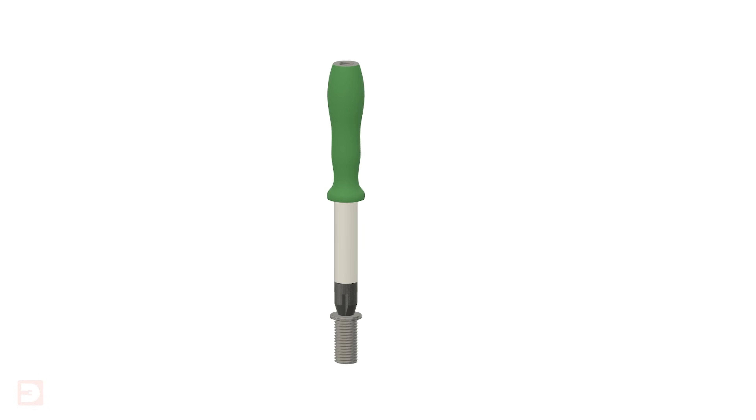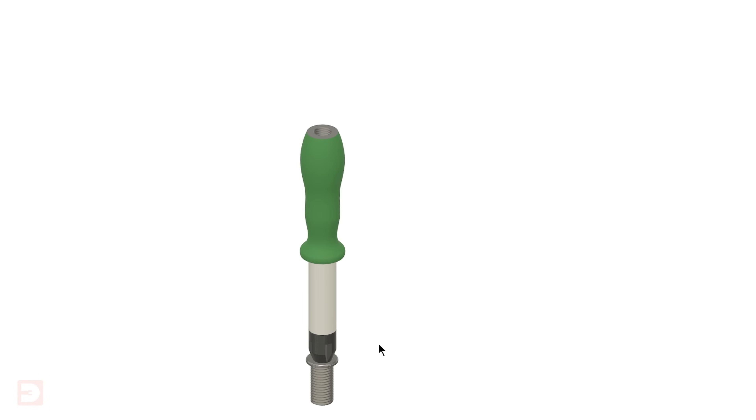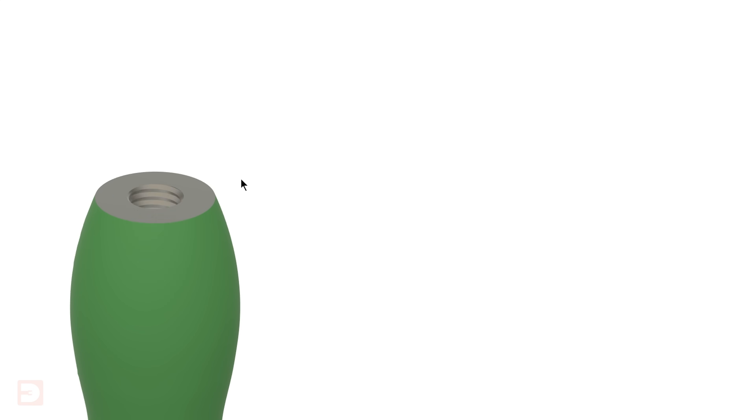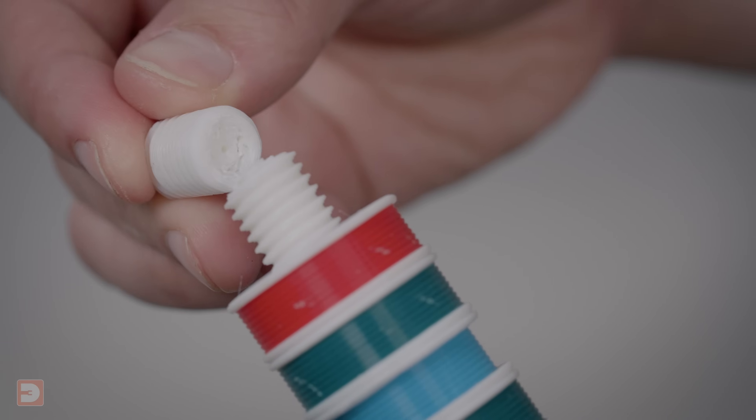The first issue to fix was easy — I took the screwdriver and just made it fatter, therefore increasing the thickness and strength. I didn't increase the size of the base screws so it would still fit the TPU foot I'd already printed. The second issue, whilst similar, is slightly different. All the screws connecting the segments of the cane together are breaking across the layer lines. No matter how I printed these screws — whether pre-attached to the main parts of the cane or printed on their own upright — they're still going to present the same weak point against lateral strain on the cane.